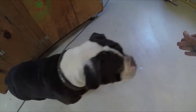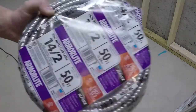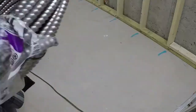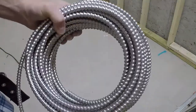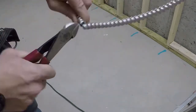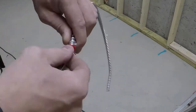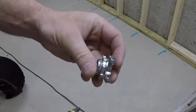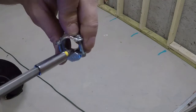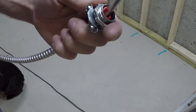Make sure you find time to mess with your dog, cat, or hamster — whatever floats your boat. Now, the clad wire can be a little tricky: bend, break, cut, strip. But the most important part is making sure you install that anti-short bushing so the sharp edges don't cut your wire and cause a short. Then take your 3/8 clamp connector, put the wire with the bushing through it, and tighten the two screws on the sides to clamp it down.